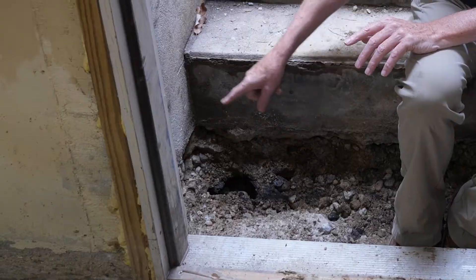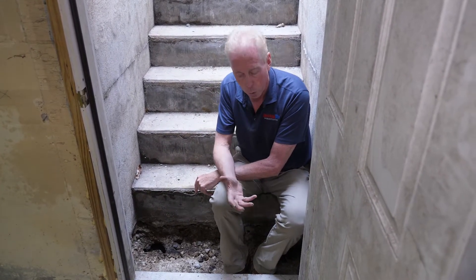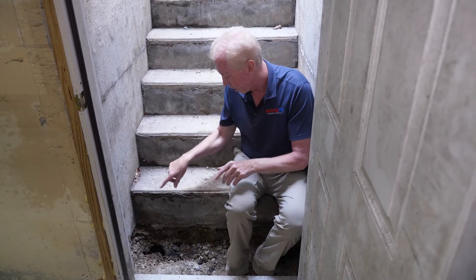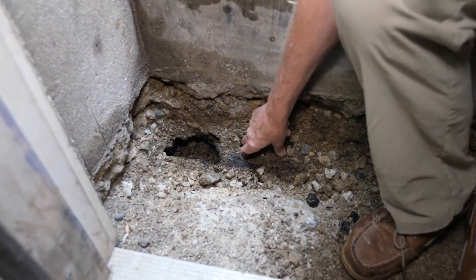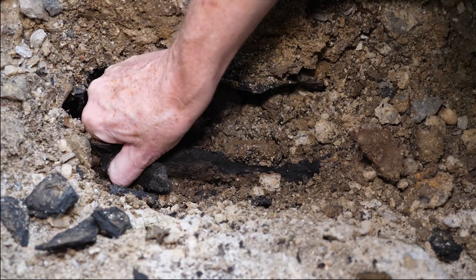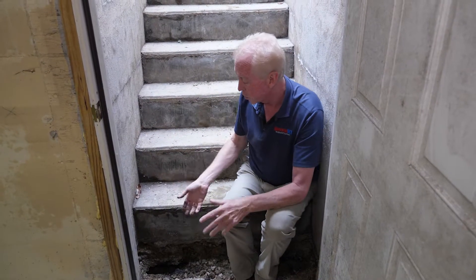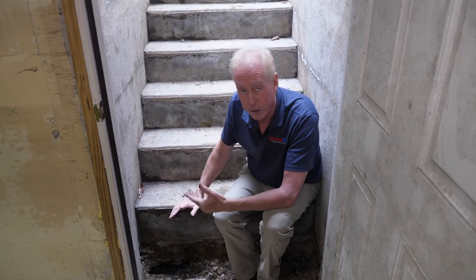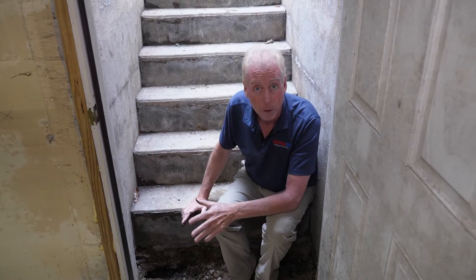As we were cleaning this whole area out, this is one of the things to talk about — there's the initial waterproofing when they built the house. They put footing drains in on the outside, and if you take a look here, there's an old rotted footing drain pipe. These footing drains were put in to take water away from the house. But this drainage pipe went all the way around the house, and the type of pipe deteriorates over time sitting in water. It's under eight feet of dirt, which has crushed the pipe and filled it up with backfill soil, rendering it ineffective.